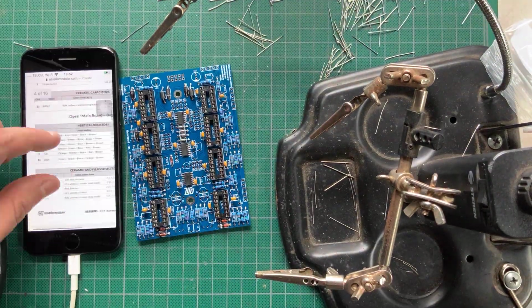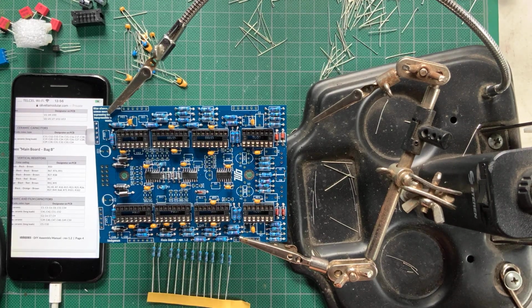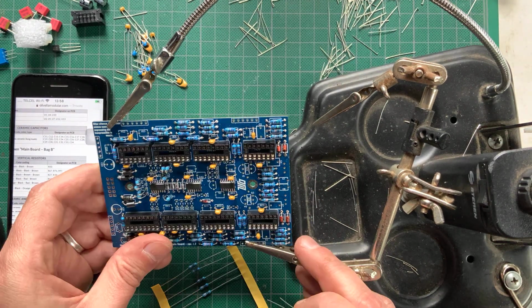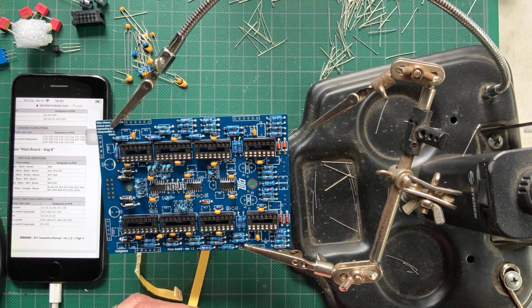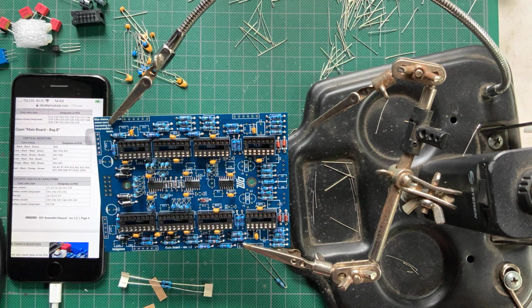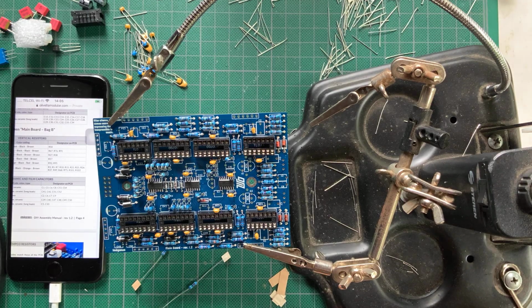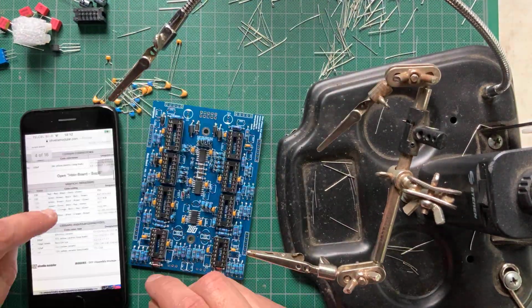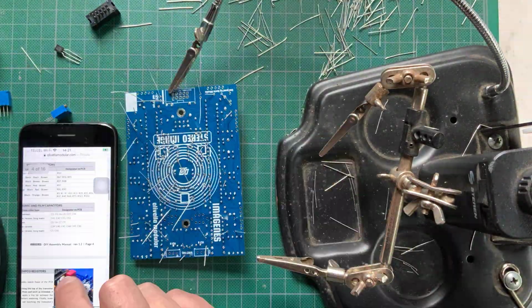Moving on to bag B, time to mount the standing resistors. Once I've measured, folded and plugged them in, I soldered each resistor's exposed leg from above, then turned the board around to finish soldering, trim the leads and touch up the work. Now plug in the red box capacitors and the tiny ceramic ones. Fold out their leads and solder them up.